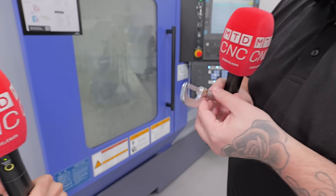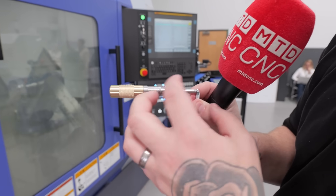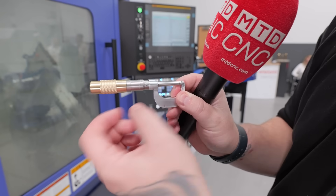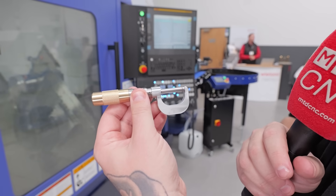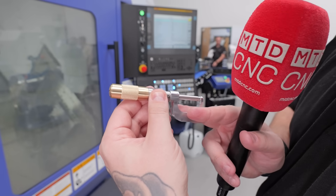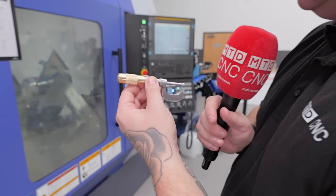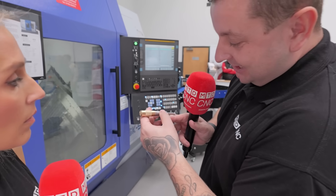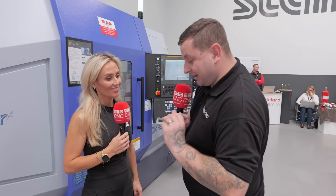This has been machined main spindle to sub-spindle. They're actually getting rid of quite a lot of material. Once you've machined all this, how do you hold it? They're actually clamping it in the sub-spindle — you don't need to have a round part to clamp. They're clamping it across there to finish this side off, and it's coming out fully complete with engraving.